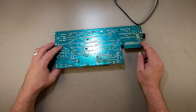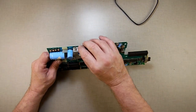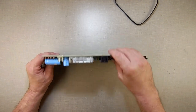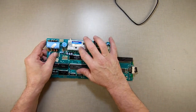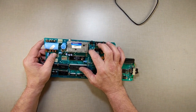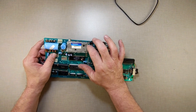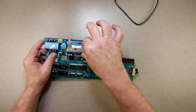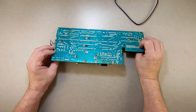While it's heating up, I'll just show you what I need to do. How do you remove those four there? Because those are what's holding the RF can in place. I also have to remove these four here because those wires go in there. Didn't get the right ones in place, but you got plus 12 volts, you got the channel selector, which is that one, you got video and you got audio go in there. And the adapter plugs into them and uses them, and then I have to run 5 volts to it from somewhere. So we're going to see how that works.